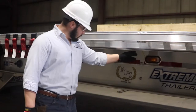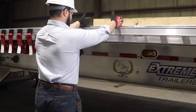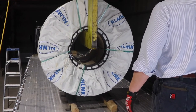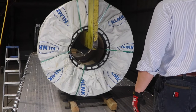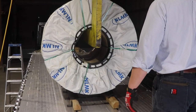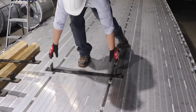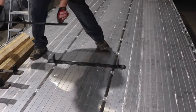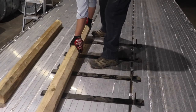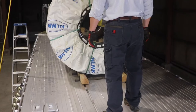The first step is proper placement of the cargo. With a single coil, the cargo is to be placed approximately one foot in front of the center light located underneath the rub rail. Furthermore, the cargo is always to be placed in the middle of the trailer to ensure the weight is evenly distributed, which reduces the possibility of a rollover. Place the coil racks horizontally on the trailer, perpendicular to the trailer's rub rails, then place your lumber into the coil racks followed by your rubber belting.